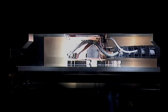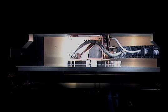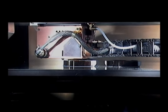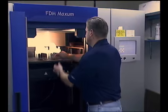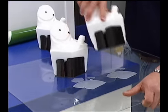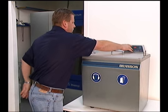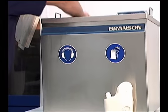This process is accomplished with all of the precision of a digital system, even allowing large complex structures to be divided into sections that will fit onto the FDM machine and later be assembled seamlessly into the final product. When the workpiece is complete, it comes off the FDM and undergoes a quick clean-up, and the support material used in manufacturing is dissolved away, leaving the final product.